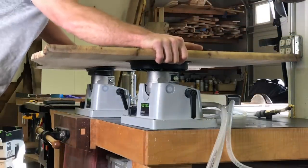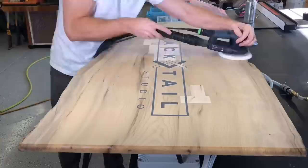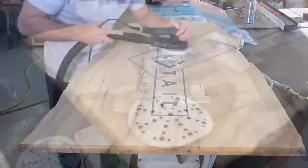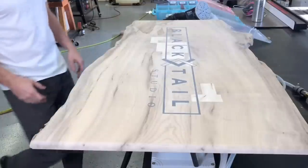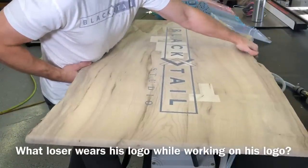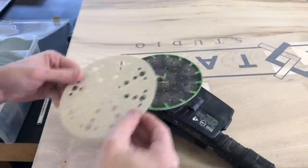These vacuum clamps were pretty handy for a project like this, so I didn't have to constantly clamp and reclamp as I was running through all these different grits, starting at 100 grit all the way up to 12,000. You're going to see me go through each and every grit just to see the sheen change. It won't look like much until we really get to about 1,500-1,800 grit. Here's 100 grit — not looking like much so far. I kept repositioning this, turning it around so I didn't have a bias towards one side, keeping the sanding completely even throughout the process.